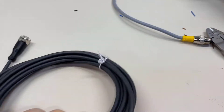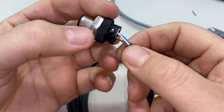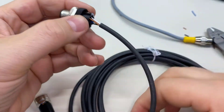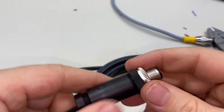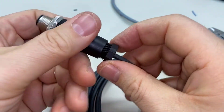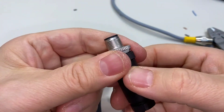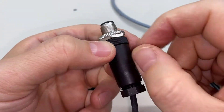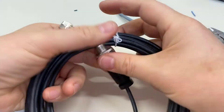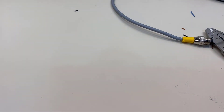One thing I wanted to show — I cut this one a little bit short, so my leads were only about a half inch long. You can still get them in there, there's just not a lot of room to work with. Once it's complete, it's fine — it's not going to hurt anything. But if you cut those wires too short, it makes it really difficult to maneuver them into the holes. Stick closer to an inch long instead of the half inch, and strip about three-sixteenths to a quarter inch of insulation off each lead.